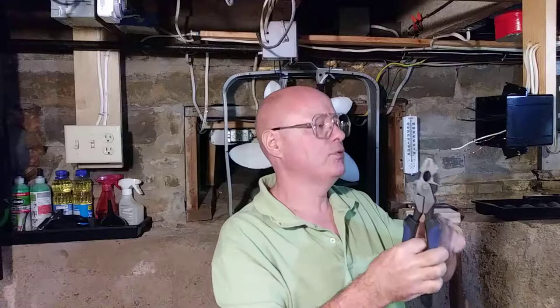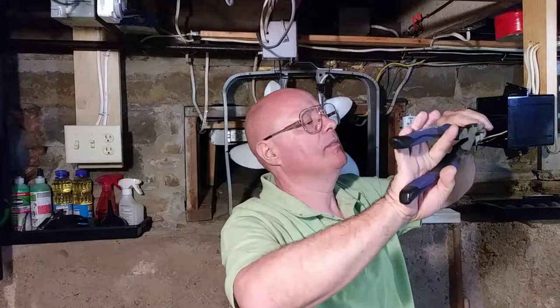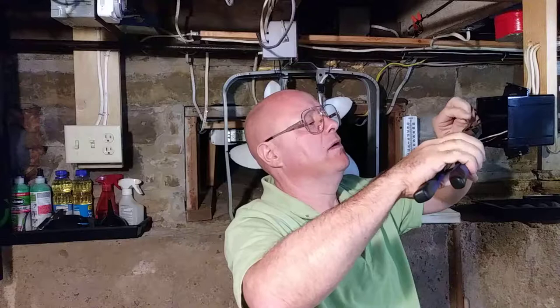Now, 3 number 14s, I believe, is the maximum you can put in a yellow wire nut, and 2 number 12s. Yeah, I started them.